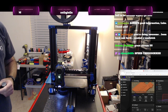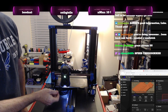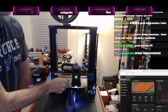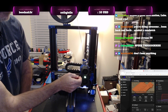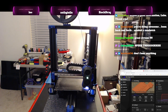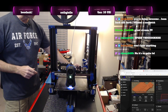Now I'm going to tell you, I'm going to take the mic. Maybe. I don't know if you guys can hear this or not. Exactly. I hear it move as it makes the quicker moves, but you can't really hear the fans. And, you know, even the up and down is really, really quiet. So, once again, that's why I love the linear rails, is they are just so quiet compared to my V-wheels. That, and then having your silent stepper drivers, you know, it's always good.